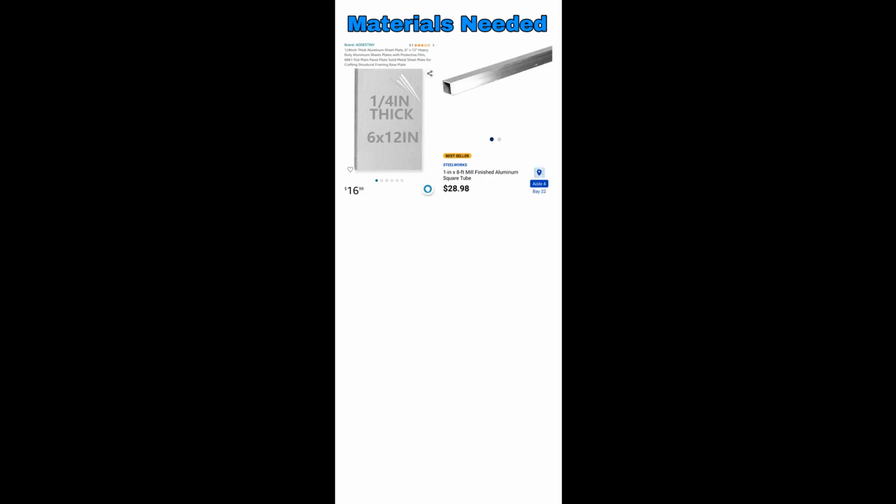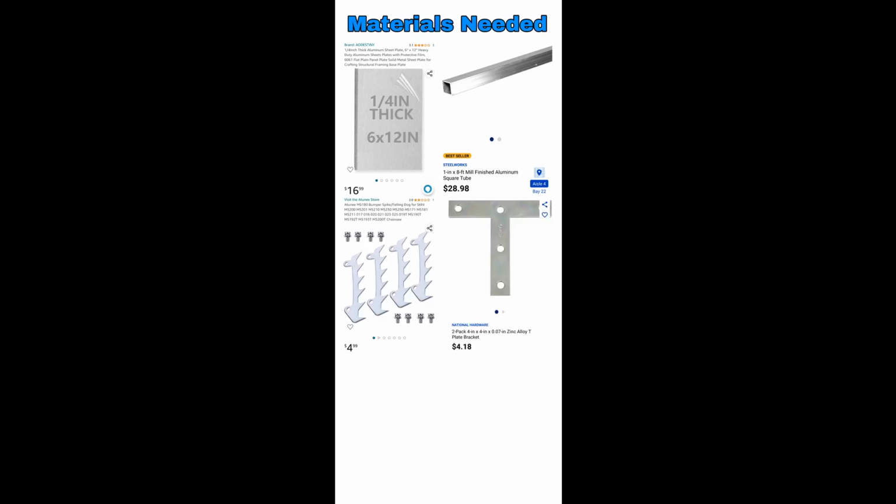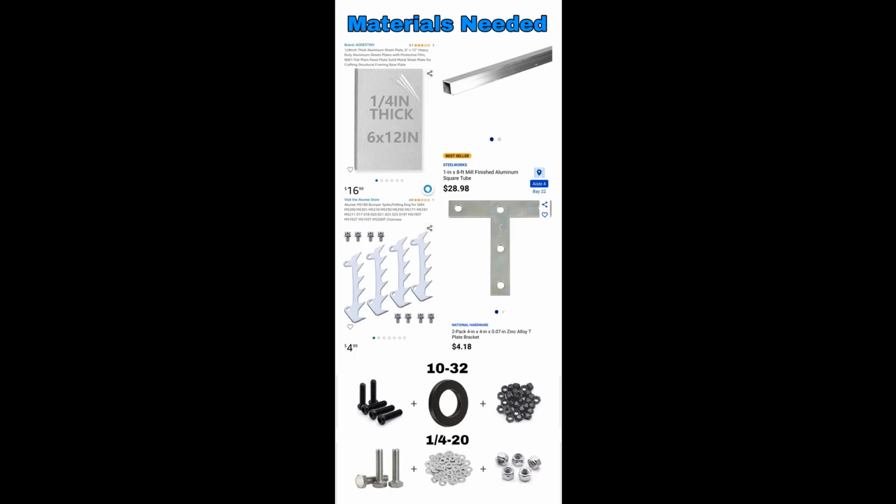Alright, let's start with the materials you need for building this habitat hook. You'll need a 6x12 quarter inch flat stock aluminum plate, 1 inch by 8 feet aluminum square tubing, a 4 pack of chainsaw dogs, a 2 pack of 4 inch T-plate brackets, some 10-32 bolts, lock nuts, and washers, and some 1/4-20 bolts, lock nuts, and washers.